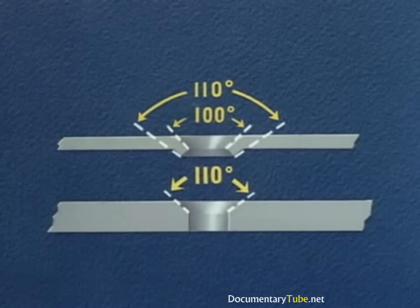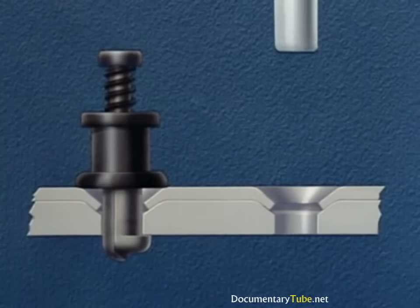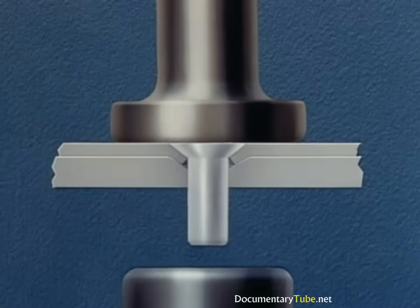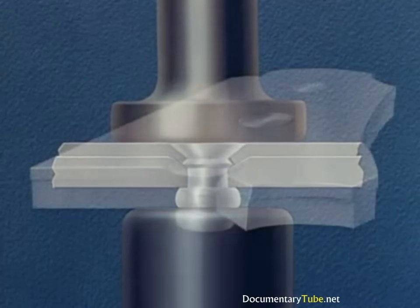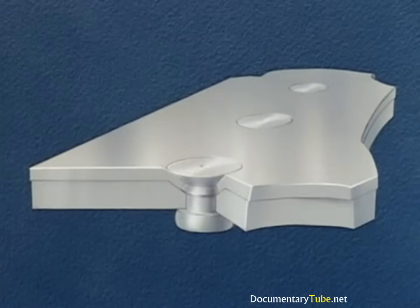Parts are reassembled using sheet metal clamps and the rivet is inserted. This is followed by driving the rivet using a standard flush driving set and bucking bar. This riveting technique is fairly simple because there is no lip on the under sheet to cause cracking or failure from clincher rivets. We have just demonstrated the combined countersink and dimple method of flush riveting, used when the sheet next to the rivet's manufactured head is too thin to be countersunk and the bottom sheet is too thick to be dimpled.